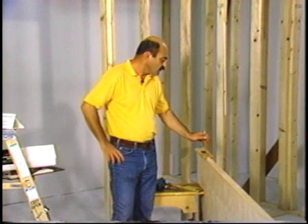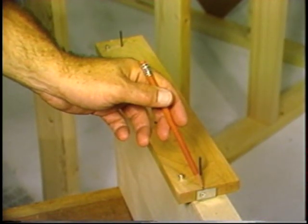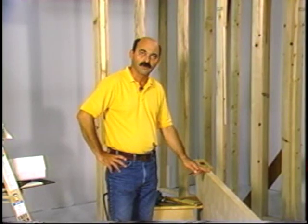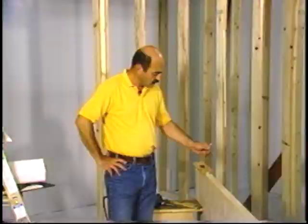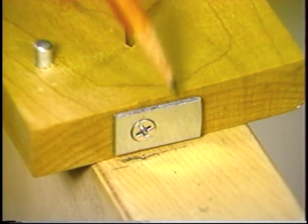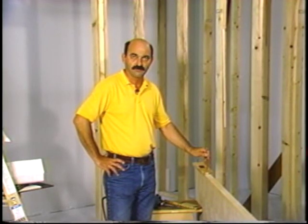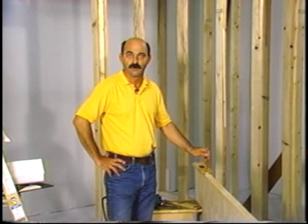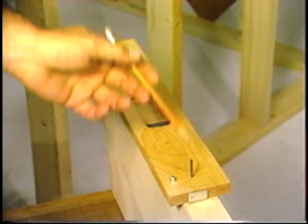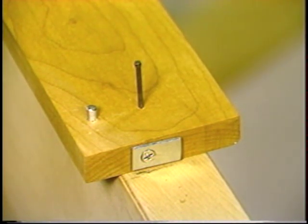You'll notice that each template has nails, guide pins, and spacer bars at both ends. This is so that it's reversible when transferring from the door to the door jamb. This spacer tab is used at the top of the jamb and can be twisted 90 degrees to hang from the top of the door so that there is continuity of measurement when going from door to door jamb. These nails, one at both ends, securely hold the template to the door and the door jamb during installation.